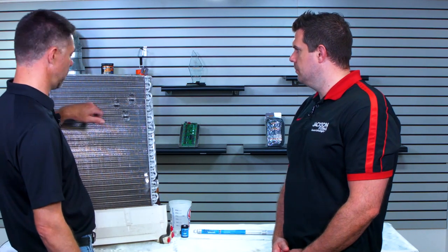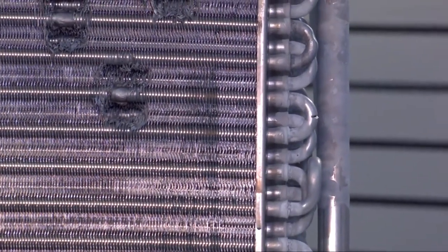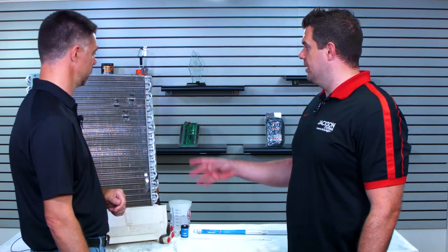But what we've got over here is a small hole punched in here. We're going to talk about pulling those fins back. And then we also have a rub out — we took a file and put a rub out point on this U-bend out here. We will be able to repair both of these spots, and then in the end we're going to put some pressure on it and show that it's holding pressure — we'll run a pressure test on there.